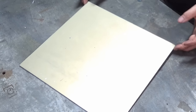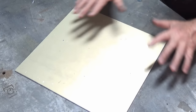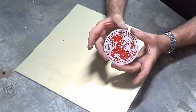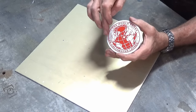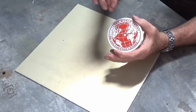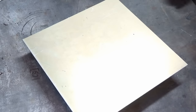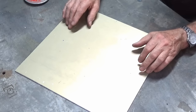The material I'm going to be working with is three to three-and-a-half millimeter thick aluminium with a coating on it, which is why it's that unusual bronze color. It came out of a skip and it's badly scratched, so I'm going to have to clean that surface up. I'm going to do this by powder coating the sheet, then laser etch the detail into the surface of the powder-coated disc. You cannot actually etch into aluminium with a CO2 laser, which is what I have, but you can selectively burn off the powder coat. Then we're going to chemically etch the surface of the aluminium to give it a uniform finish, and then put a clear coat over it. This project is going to push the limits of all of the equipment I have — it just fits in my CO2 laser, only just fits onto the face plate of my lathe, and barely fits into the powder coating oven. But I've checked all of those things and I think it's doable.